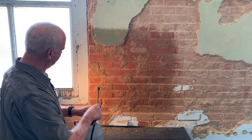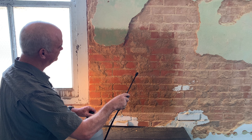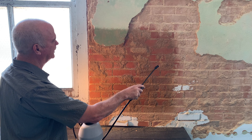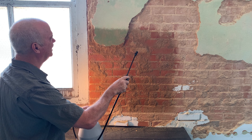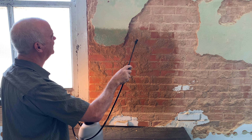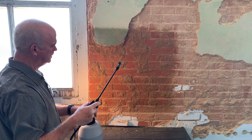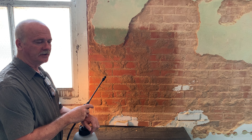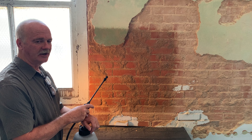We're still looking for that six to eight inch rundown. There's probably going to be some slight darkening to this wall. We will come back after three days — it's fully cured in 72 hours — and we'll come back and run our brush over and check our progress.